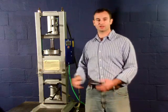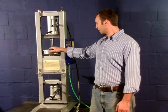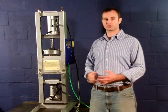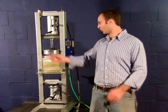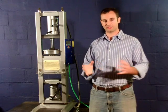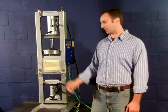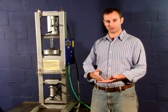There is a hopper that holds about two pounds of material, and you will fill it up to about here. Inside the hopper there is an injection tube that contains the injection barrel. The injection tube has a hole on the bottom that the material falls into. Once you retract the piston, the hole opens up for the material to fall in. Most of the time it will fill up almost completely by gravity alone, although sometimes you might need to use a spoon or spatula to help push it in.